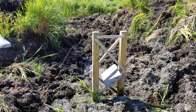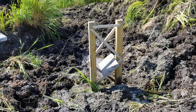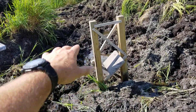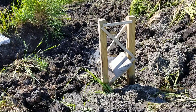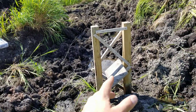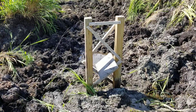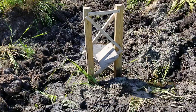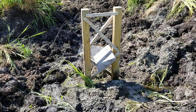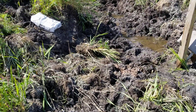We're going to install the inline water control structures here. I did the prep last fall — the posts are set about four feet down in concrete. What I need to do now is get the laser transit set up, check all my grade, smooth things out, and set my pipe. I also have this concrete block patio paver — that's where the water control structure is going to sit. I want to get that level and pour a couple bags of concrete around it, since there'll be water down here most of the time.